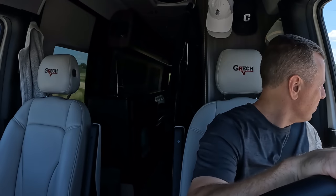The VB air system basically replaces that and has airbags, and that's all you have. So if you ever have one of the airbags go out, like we were talking earlier, then you're going to be stuck on the road, and you're going to need a repair. You can't drive anywhere if one of the airbags goes out. With the Kelderman system, if an airbag goes bad, you still have your leaf springs because it's connected to the leaf springs, so you don't have to worry about that. And now, knowing how they're made, it just makes you feel that much better.